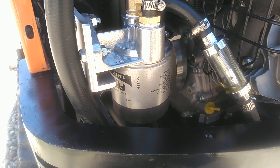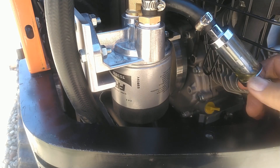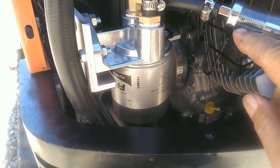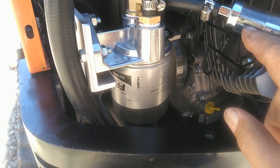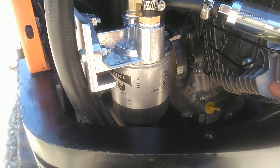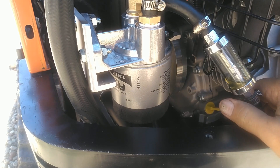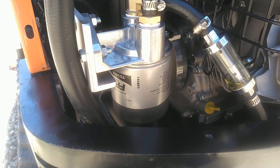I did a test run — it does pump oil, but just not as much as I'd like. It was just kind of dripping — drip, drip, drip. So we're going to fall back to the electric pump and see how that works. You can see the oil in the sight glass; it just was not flowing at a good rate. There must not be enough crankcase pressure to drive this effectively. Disappointing, but that's all part of learning — on to installing the electric pump.